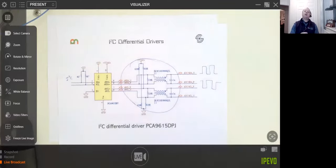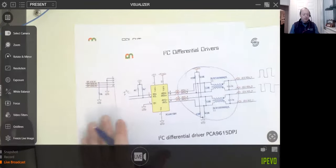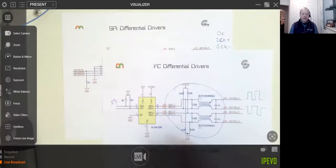Yes. So the only thing I'd say, just make sure you pair things up correctly, because when you look at the configuration of Ethernet, you know, where are the pairs? But that's the only thing to pay attention to. And I think you could use, is it RJ50? I think you've probably got like 8 pairs or something like that in RJ50. And certainly to send the entire serial bus, you just need 5 pairs, which you can get in a cable off the shelf, job done.